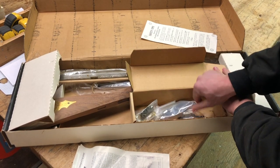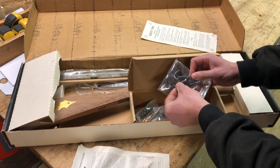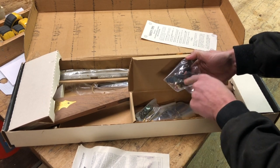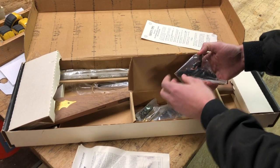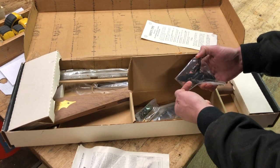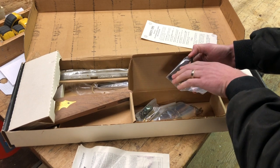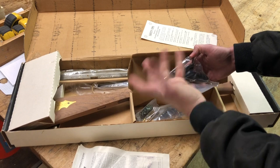We got all of our little packaged components — there's the hammer and the spring. I wonder if the spring is still good; maybe we'll have to replace it. It looks like it is under some tension, but over time a spring can take a set. I think you want a strong spring because when the hammer comes down and hits the percussion cap, there's pressure that builds up in the bore to push the bullet out, but there's also pressure pushing back up against the percussion cap. The spring needs to be tight enough to hold the hammer down so it doesn't open up — otherwise you could lose pressure or it could even be dangerous.